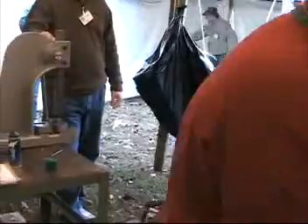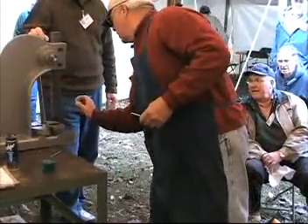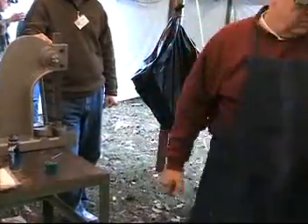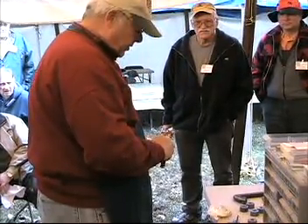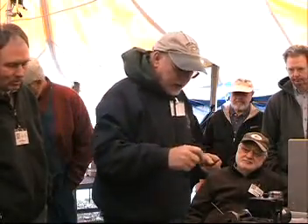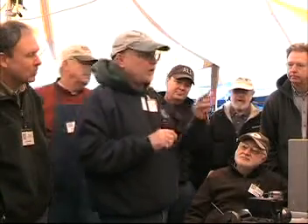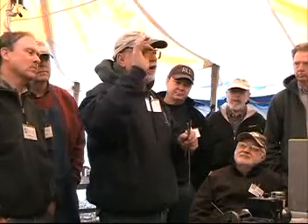How much was that reduced? We went through a 280 — it was 290. You started at 295 to set it on the mandrel, and we have a 265 roughly. Step downs. Same way. We've got here 15 ID. Here's another piece of 15 ID. We're working with 2/64ths difference all the time. This is a piece of 13 ID barrel tubing which has an OD of 15, because it's got a 1/64th wall. So 2/64ths difference.